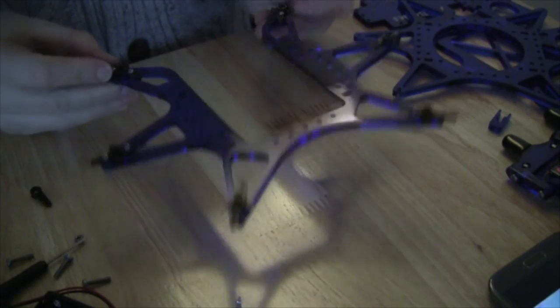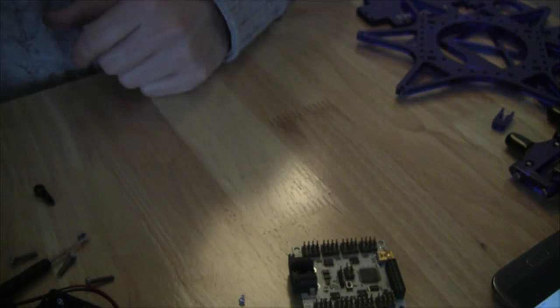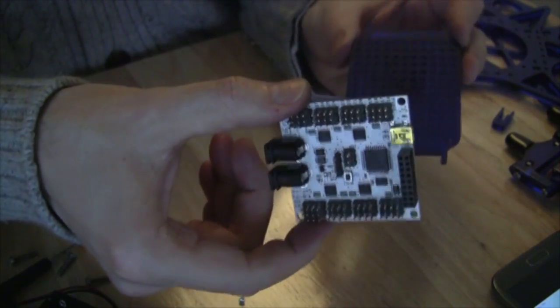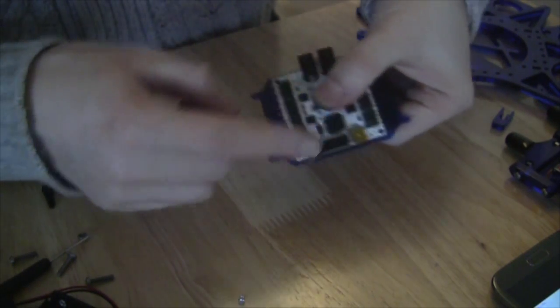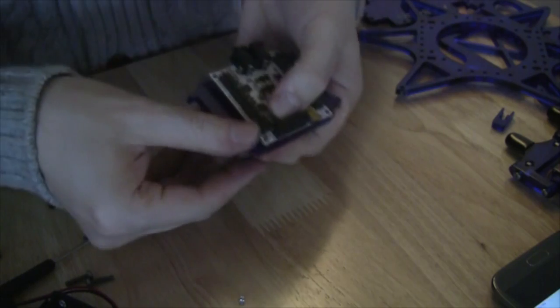The next step is going to be to mount the controller board to the controller base. Here we have the controller board — you've already used this to align the servos for the various legs you've created. The controller base is actually square and you're going to want to affix it to the board appropriately. The screws can only go in the four corners, and you will be putting a medium screw through the bottom up towards the actual controller face, so the screw should stick out like that.